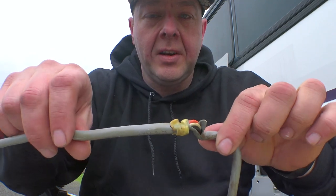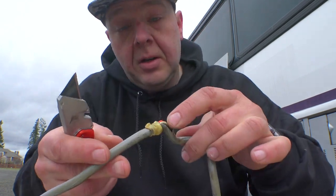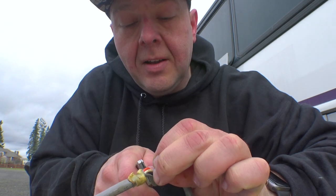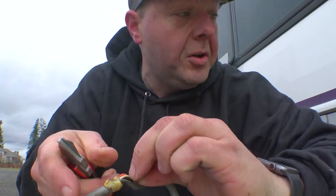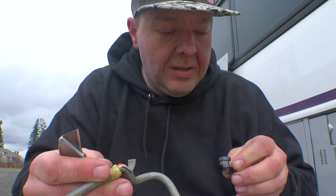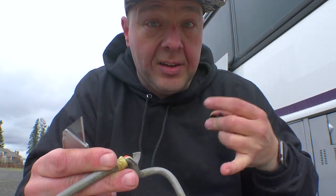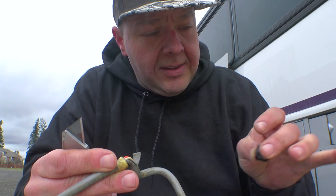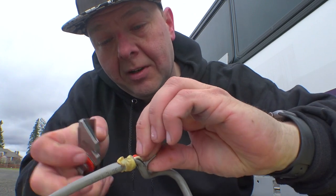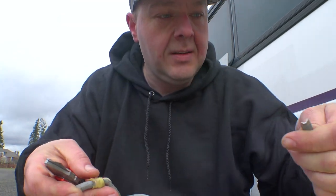I've got enough wire pulled through here now. We can investigate this a little bit — I'm probably going to trim it down somewhere. I want to peel some of the sheathing back and see if we can find the actual aha moment where there's a broken wire. This wiring is pretty old and I don't really like these bends. At some point we're probably going to have to actually rewire this. Let's see right here — there's a really tight kink in that wire, and it just snaps right off. It's a little bit cold out here today.